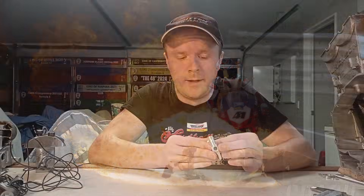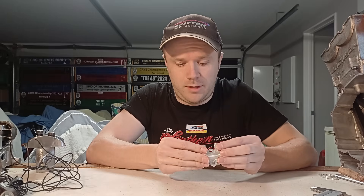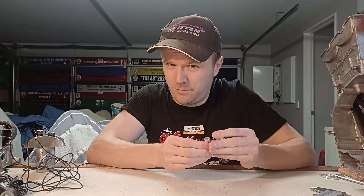The one mistake is that those two oil gallery holes are not centered, and it is pretty thin on one side — so I'm not willing to risk that, especially on a pressurized oil fitting. I'll have to make another one when I have a spare minute, but this took a fair bit of time with prepping all the stock and about four or five different operations.